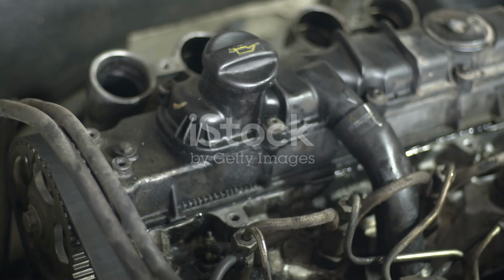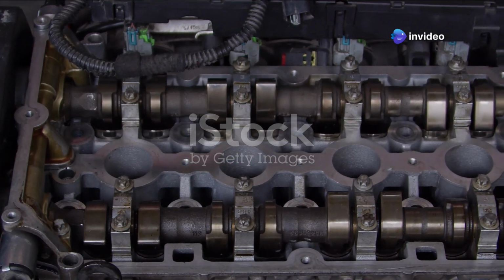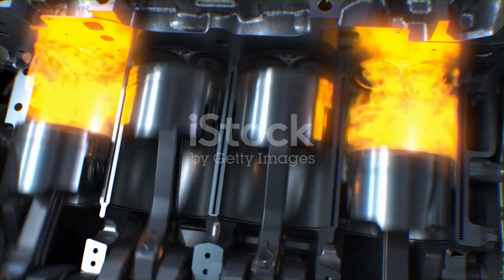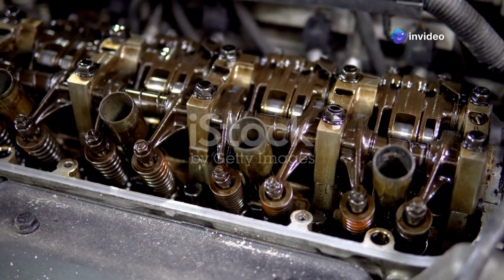The fuel-air mixture is ignited by the spark in the combustion chamber and commences burning as the piston travels toward top dead center on the compression stroke. The ignited charge is rapidly expanding at this time, and pressure is increasing so that, as the piston travels through the top dead center position, it is driven downward on the power stroke.